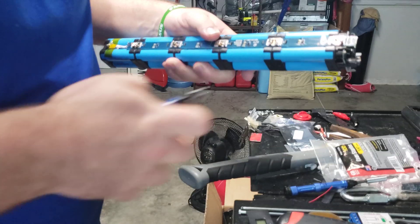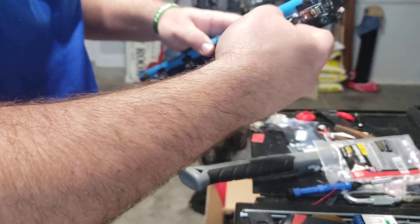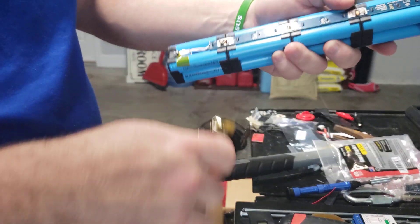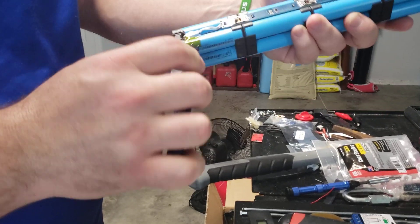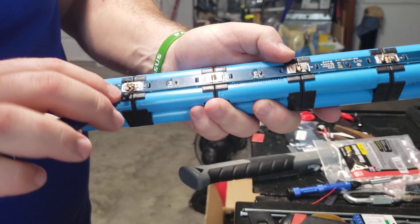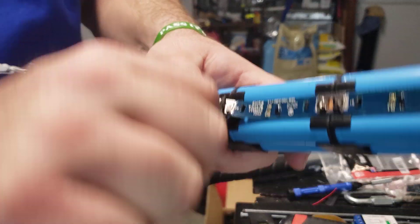Two of them worked out and they're doing really well. I'm also waiting on another shipment from the same people. Now you've got your caps and tape. You don't want to pry on the board — I don't want to dent the cell — so I try to get whatever I'm using to pry on this plastic piece here, and these little tabs will just pull right through if you've cleared them all the way.